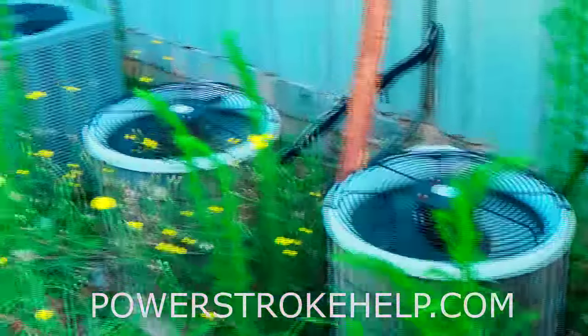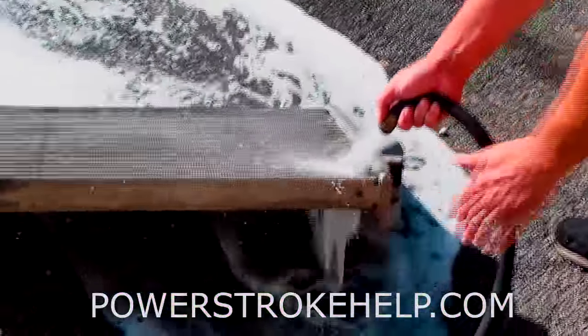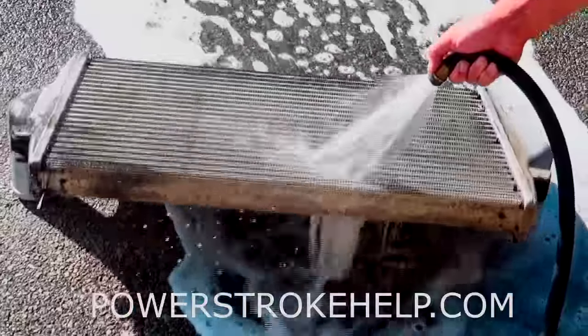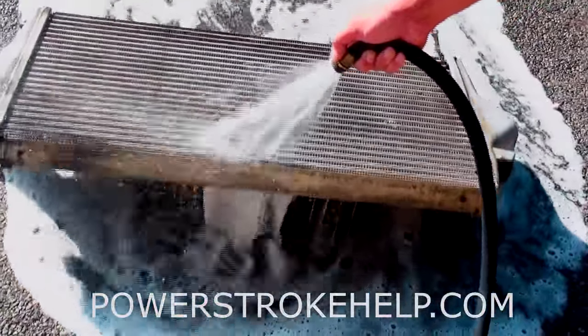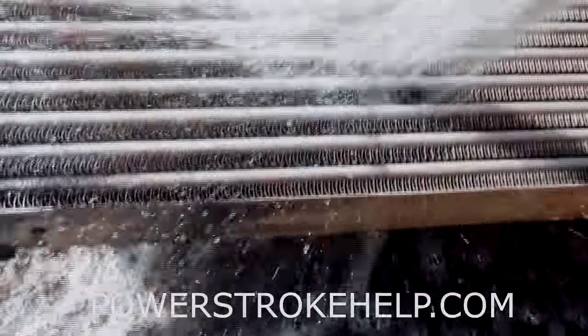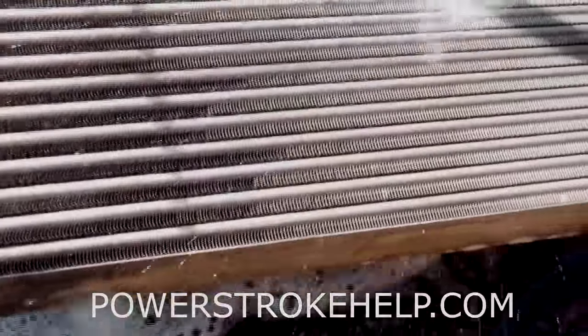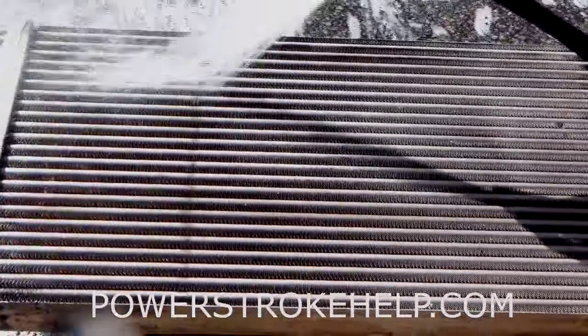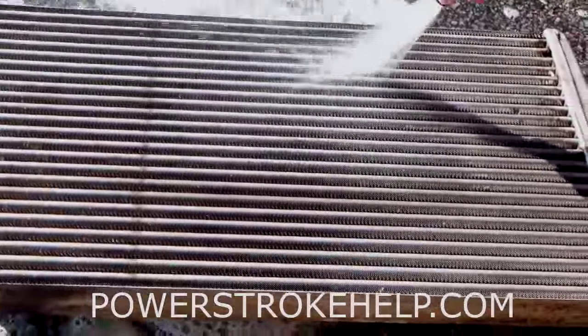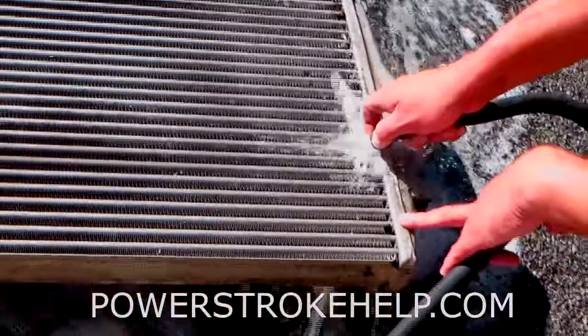Use this coil cleaner that was really designed for these type of air conditioning units. These look like they need to be serviced — weeds growing up around them and all. It's just a matter of washing it out with a good strong hose. You don't want to use a pressure washer at all. But look at the crud just jump right off there — it just comes right off. You want all this black stuff to come out and clean the coils. Every little bit of debris is going to make this cooler work with less efficiency, so take your time and clean out all the coils so that they're as clean as they can be.